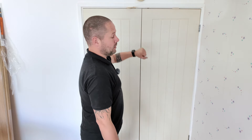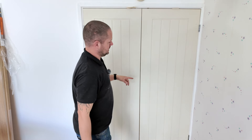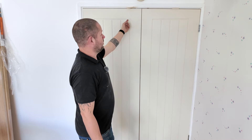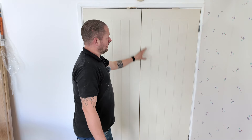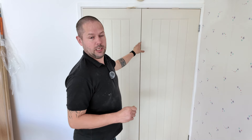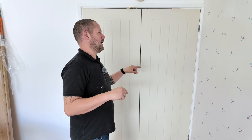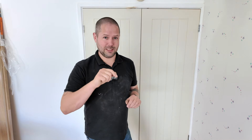All we've got to do now — which I'm not going to do on film because I've done loads of videos on latches and hanging doors — is put two rollerball catches at the top and a pair of handles on there. You could put a shoot bolt on the inside of one of them, make one a lead door and one a slave door, and then put a normal latch on it. But in this instance I'm going to have two rollerball catches. The next video is going to be the inside of this cupboard being turned into a little office space, so if you're not subscribed, hit that subscribe button.